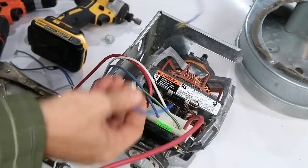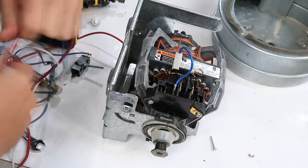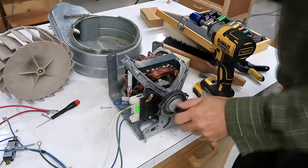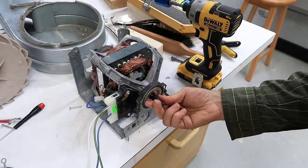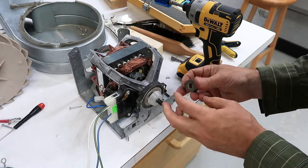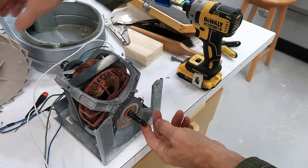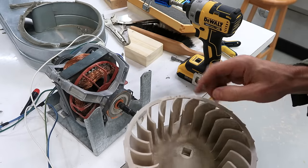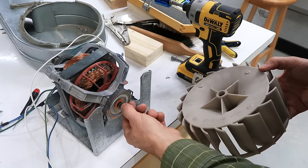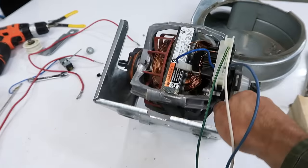I'll just bypass this switch here. Don't need these red wires anymore. This is a nice screw thread on here — clockwise, fortunately — so I'm going to put this pulley back on here because maybe I'll want to use it. On the other side, unfortunately, this is a counterclockwise thread, and the only nut that'll fit on there is the one in here. So I definitely have to keep this part because I might want to extract the nut to use on this side. I'll keep this motor mounted on this metal frame because I think that'll be much easier to mount to something else.